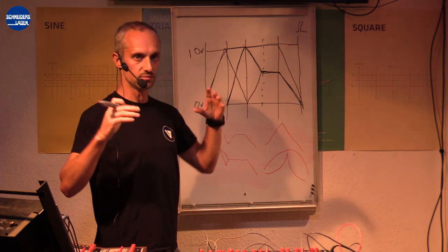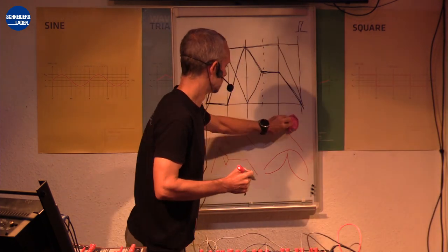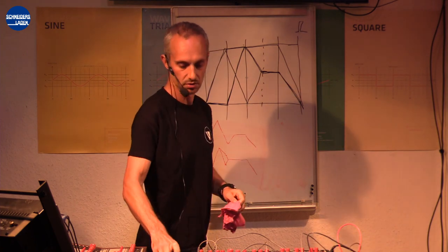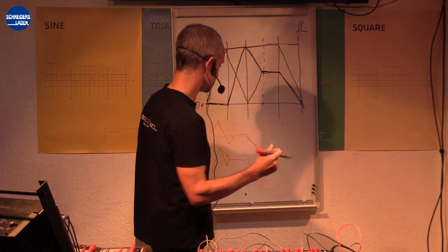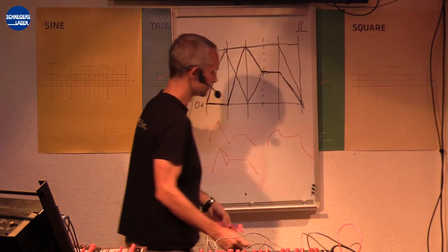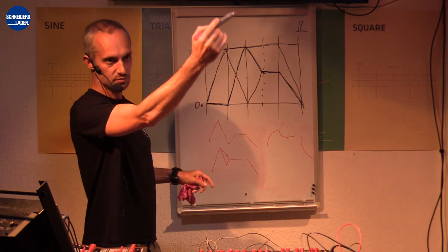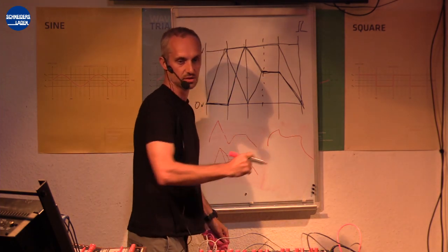what a classic sort of East Coast envelope generator looks like, because the envelope generators that came from most synthesizer manufacturers, from Moog or Roland or ARP or whatever, all of those use what they call RC curves, which is electronics talk. It means resistor capacitor, but it essentially always starts moving quickly and ends moving slowly. So the attacks are convex and the decays are concave.